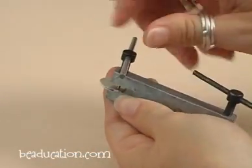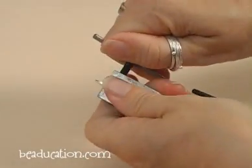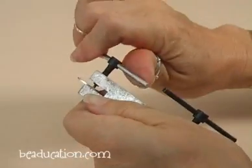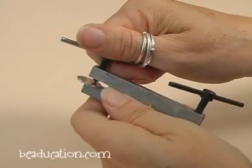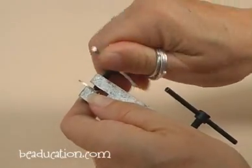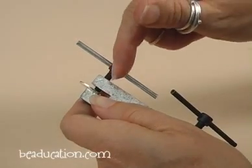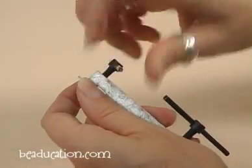So I'm going to get a nice tight grip on the tool and screw down. Now the harder the metal, the harder it's going to be to screw. I'm going to continue screwing here until I feel it lighten up. It's pretty hard to turn right now — and right there it got a lot easier, which means I just popped through the metal. I don't want to keep screwing, because if you go all the way down, this thread is going to mar a little circle around your hole, and that's not good.